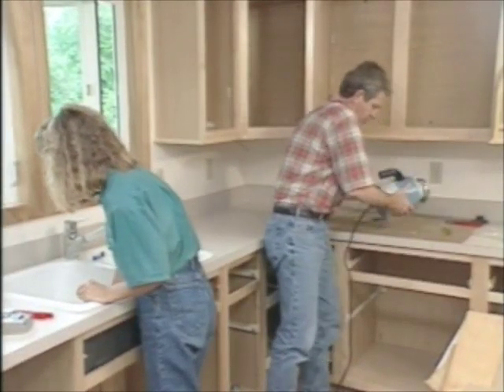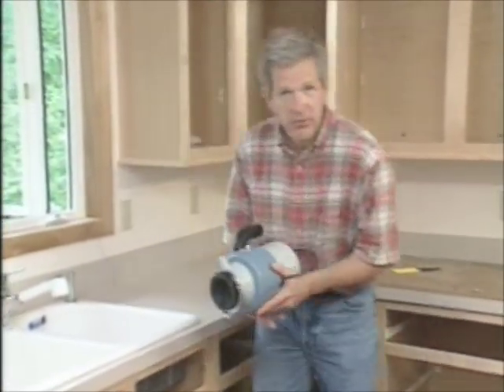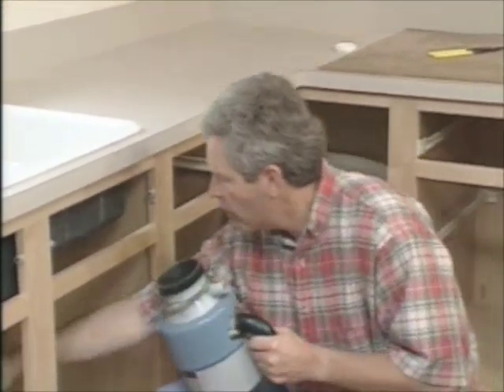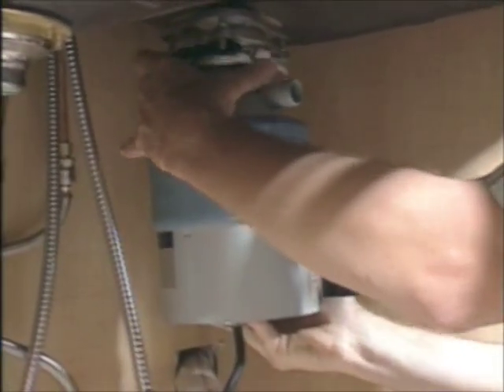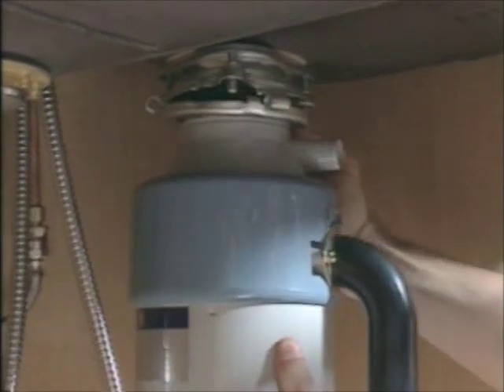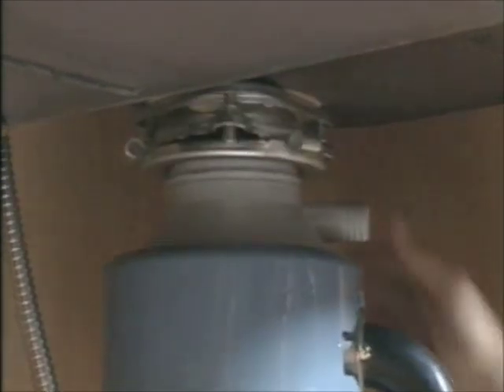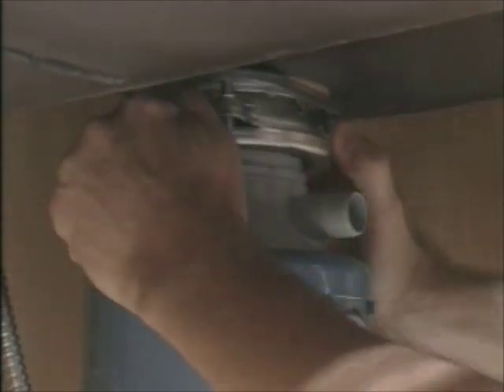We ordered a double bowl sink. The bowl on the right-hand side is for the disposer — it's a little more shallow. We installed a special drain and mounting assembly for the disposer. You attach that through the hole in the bottom and then attach a special drain adapter to the drain on the disposer. Before you can hook up all the drain assembly under here, you do have to get the disposer in place. It's a fairly straightforward connection; the hard part is just getting the adapter ring up there so everything hooks up. It takes a little bit of trial and error.